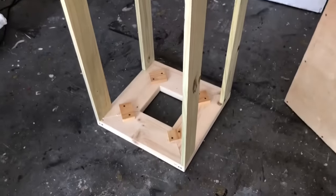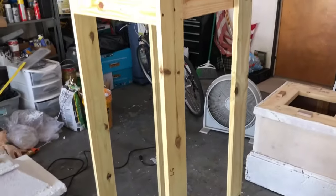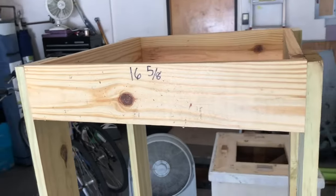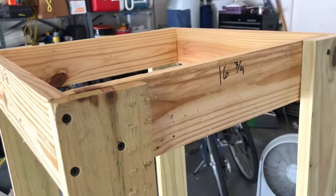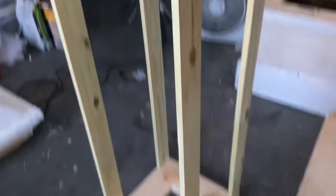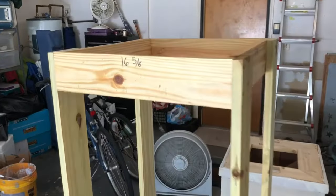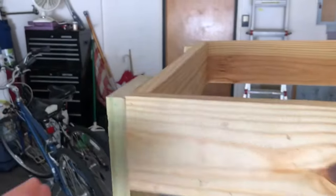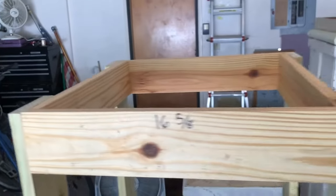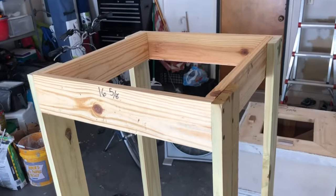This base is 18 by 18 inches. This vertical one by four is 57 inches in height. Up here this one is 16 and 5/8 inches, and this one is 16 and 3/4 inches — that makes the top and the bottom the same width. This column will eventually be five feet in height, but the plywood is going to overlap a little so that the lantern section, the top portion of the column, will be able to sit into it.